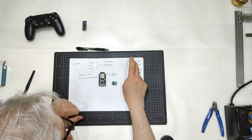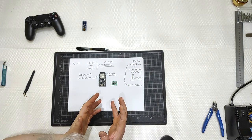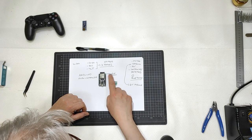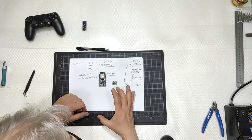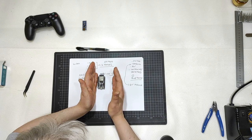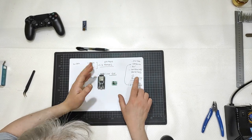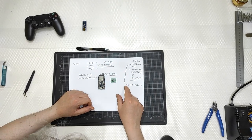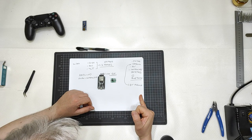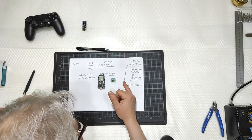How will I control the motors? I needed something to drive the motors. Because it's not just the info that gets here and then gets out. It needs to be translated and interpreted, what the brain here, the ESP32, will have inside: all the functioning, all the input lines, all the instructions to make the system work. But then the instruction needed to be learned and understood in order to give the info to the motor. Go one step ahead, one step clockwise, one step counterclockwise, go faster, go slower.